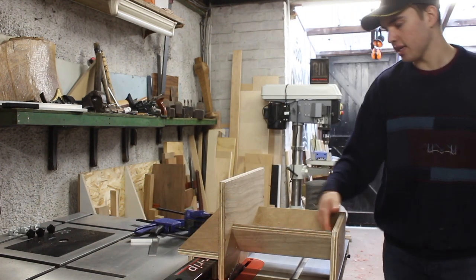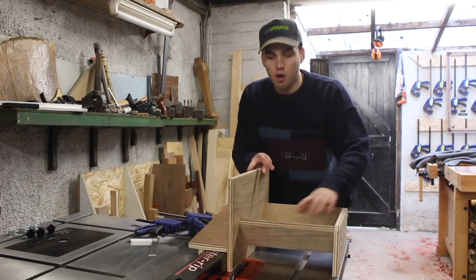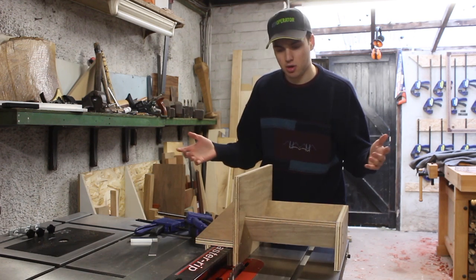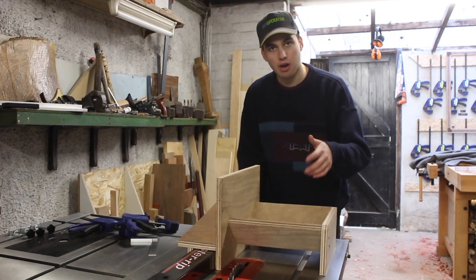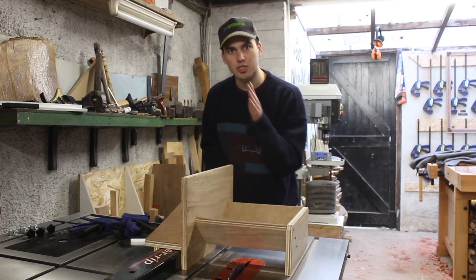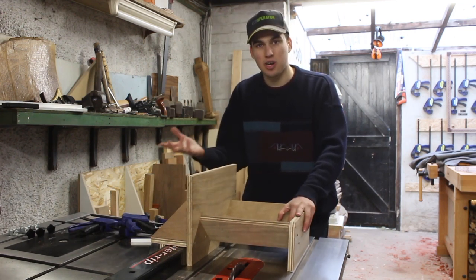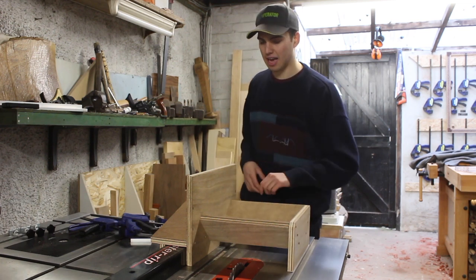You may be wondering why I made these walls come out so far if I'm just making picture frames. The reason is quite often if you're making boxes, you can mitre the boxes and add splines there. So if I wanted to make a set of jewellery boxes, I can put the box on its side, run it through, and then move the fence again to make another saw kerf — so I can get splines all the way down the side of a box. They also look very decorative. I wanted to make this jig a two-in-one, so I wouldn't need to make one for boxes and one for picture frames. So I just extended that out further.